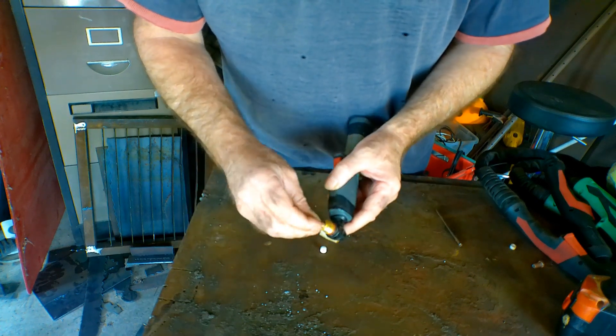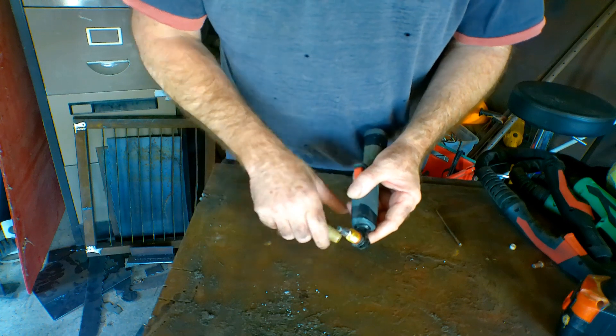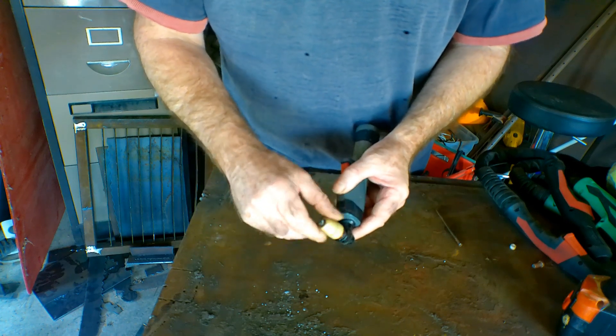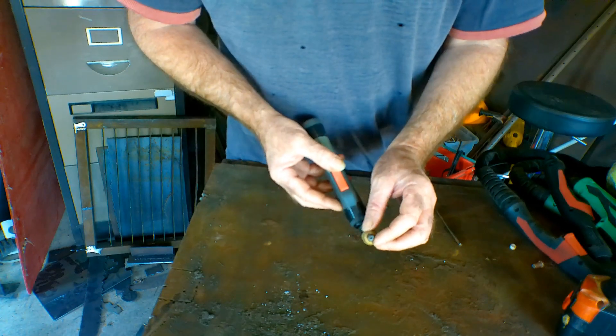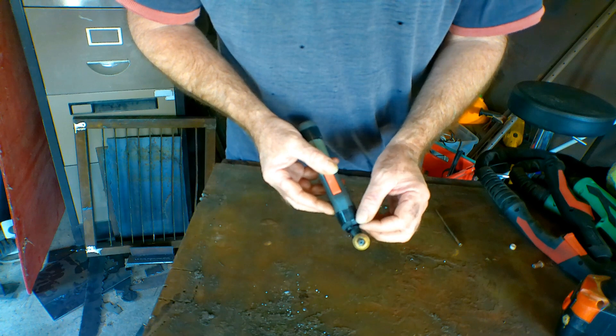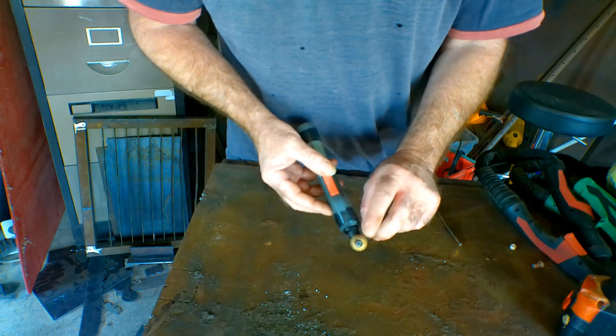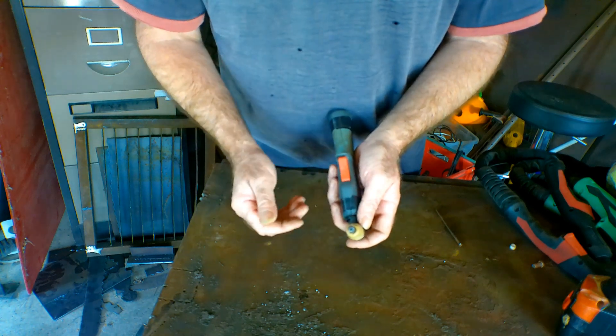So we can reassemble this PT31 torch there and we'll be good to go again. So there's a little hack for you guys — maybe you had the same issue that I had with these PT31 torches. Like I said, they're really, really good, but that's the only thing I find — they tend to burn out the head. Even if it's just a little bit loose and it starts vibrating, you've got all sorts of issues.